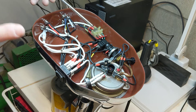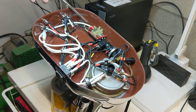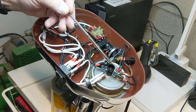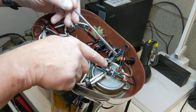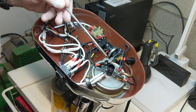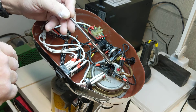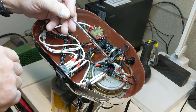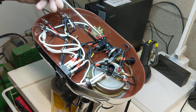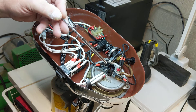In the US system polarity is maintained, so the black hot wire comes in and goes all the way around to the thermal fuse first. If the thermal fuse pops, all power to the whole machine is off. It kind of acts like a thermal breaker — if it pops the machine has no hot to it, and it gets shut off at that point.